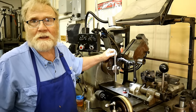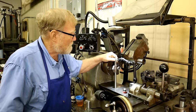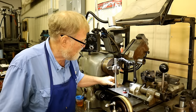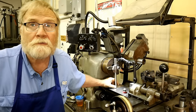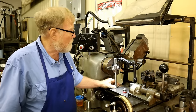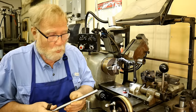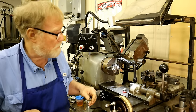This has proved to be a problem. Those are reamed holes, as you can see from the last video. This is a piece of stainless steel precision shafting, but they missed their mark when they ground this. It's a thousandth undersize. Which, for this, it doesn't matter because we're going to tighten it up.